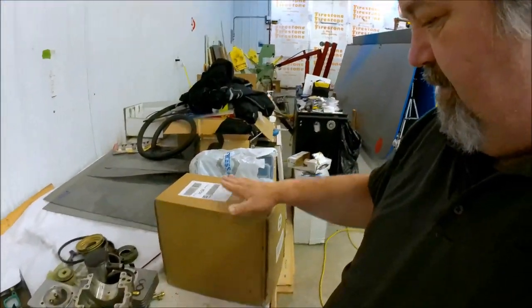That bearing does make a little bit of noise. And the old saying is, where there's noise, there's wear. The other ones are absolutely whisper quiet — nothing at all, and very smooth. What I have in this box here is a clamshell bearing puller.